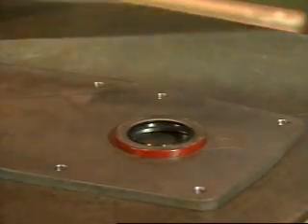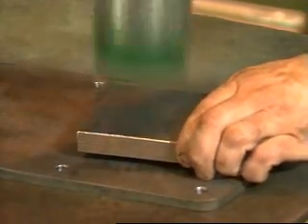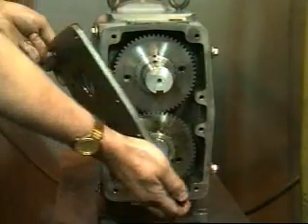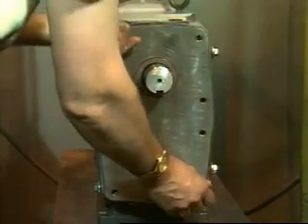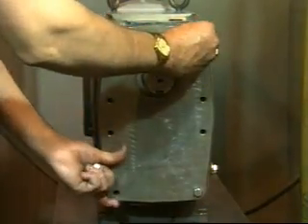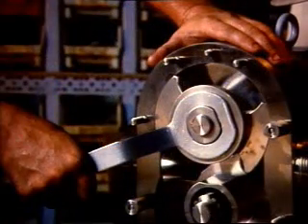Press a new grease seal into the gear cover. Place the gasket over the gear cover and mount the cover assembly over the shaft extension onto the bearing housing. Fill the gear cavity with microplate number 140 oil to the proper level. You are now part of the Waukesha pumps tradition. By following these procedures, your Waukesha pumps will provide long, trouble-free service.